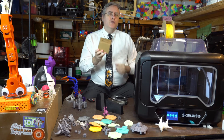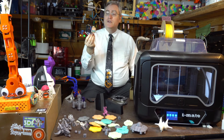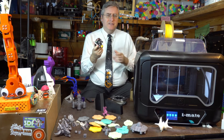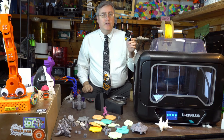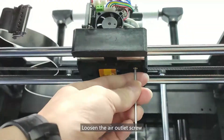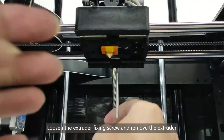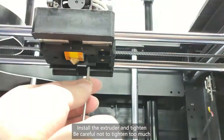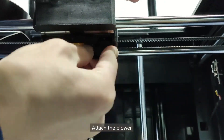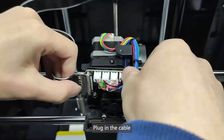QD Tech also includes a 0.2 millimeter printhead. At first I thought it was just a new nozzle, but it's not — it's an entirely new extruder assembly. I don't need to be doing 0.2mm right now, but I'll check it out in the future. The installation video was four minutes in real time: detach the connector, remove the screws, put new screws in, reattach the connector, and you've switched out your entire printhead. If you've been 3D printing for any length of time, you know most failures happen right here — mega clogs, cooling failures. QD Tech has made it so easy to replace this entire assembly that future repairs will be super simple, meaning this printer is going to keep working long into the future.